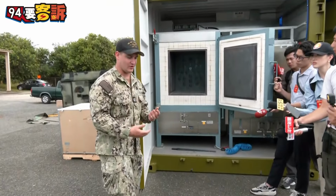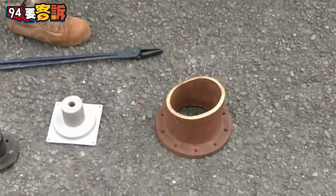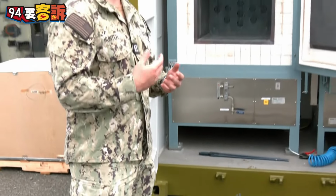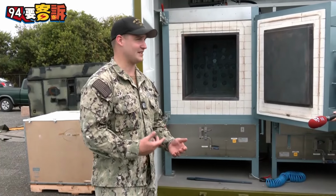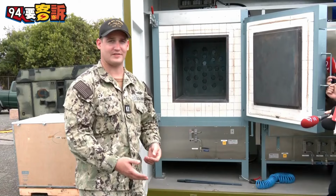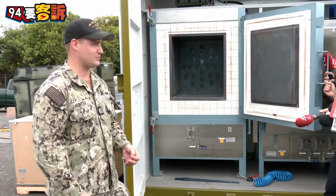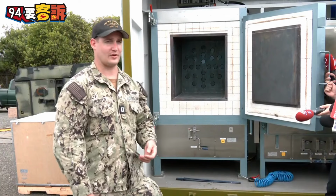The material is what you would see after the post-processing on this upper lip. So you can see that it is actually a good aluminum bronze, something that you would see in most traditionally manufactured parts. Just in any process, casting, welding, however you're going to create your part, it's going to have a rough layer on the outside until you go through post-processing. So the idea here is that we can create a net form object and then post-process it to be the final object that we're trying to create.